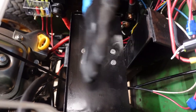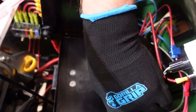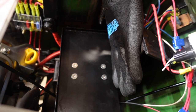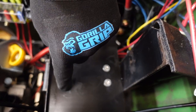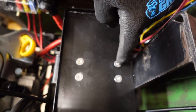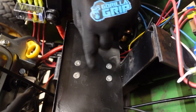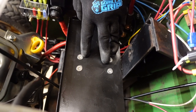I made this tray out of sheet metal. It already had one side folded up from being part of an electrical panel. I cut the sides a little bigger, put it in the vice, and bent the sides up to give it more rigidity. I left one side open so water can drain off. I drilled out four quarter-20 holes, countersunk the sheet metal, and also countersunk the steel it screws to, so the screws sit flush.